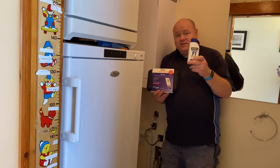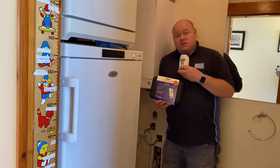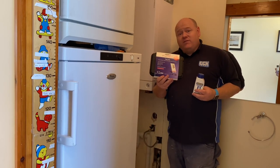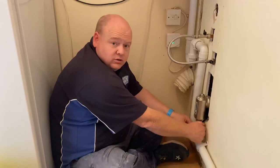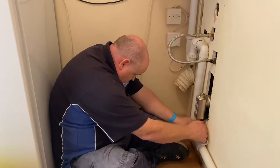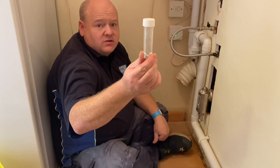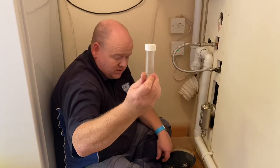I'm just going to put some F1 inhibitor into this system now. These are quite good - little bottles that fit in the filter, nice and easy. We're going to run this round into the system and then test it with the AD Pro Check. We've put our inhibitor in the system now. The boiler is running round for half an hour letting the inhibitor circulate. Now we're going to take a little water sample. See there - it's really clear, a few bubbles because it's warm. We're going to do a water test on that with this kit.